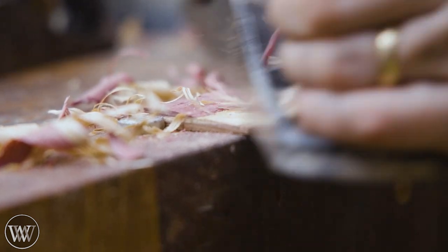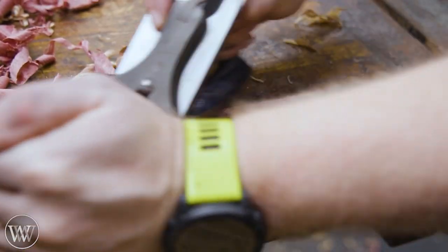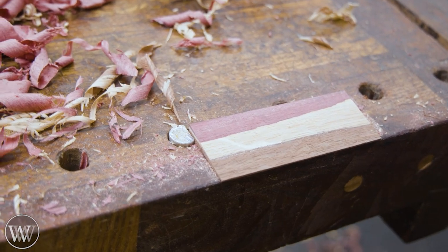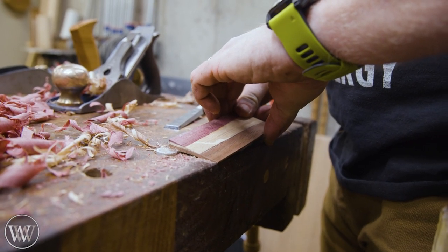For the first side, I'm rough planing it down until I see all three of the colors come through, and then I'm going to switch over to my smoothing plane and detail it down until I get this nice schmoo between them. I went a little bit too much on the padauk, but that's okay. It's a little bit thick still, so I can still peel it off the tape very easily.